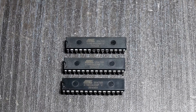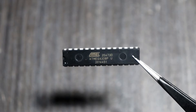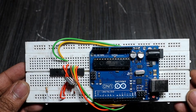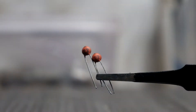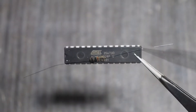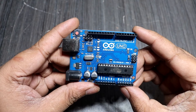Now follow the steps to burn a new unprogrammed ATmega328 chip. Before you go to burn the bootloader on a new unprogrammed ATmega328 chip, you must make a breadboard bootloader circuit setup. For this bootloader breadboard circuit you will need the following components: two 22pF capacitors, a 16MHz crystal oscillator, a 10 kilo-ohm resistor, your unprogrammed new ATmega328 chip, and an Arduino Uno module.